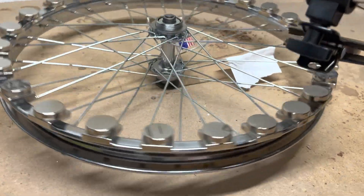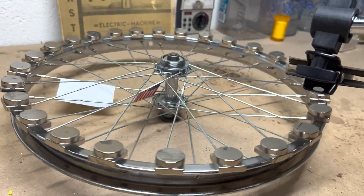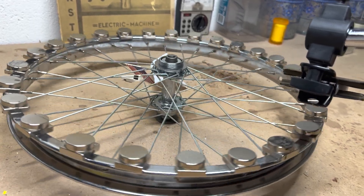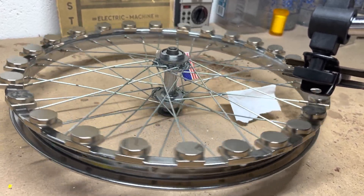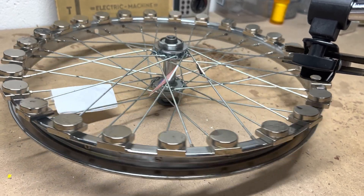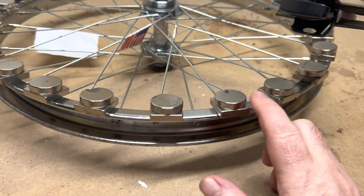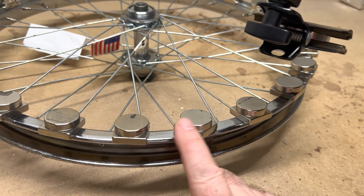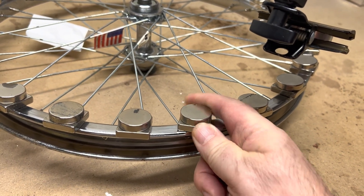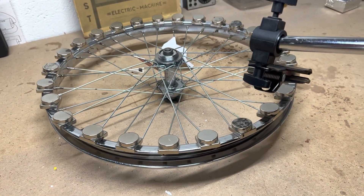Watch what happens here. I have to hold this armature because it shakes. See, it wants to run — that's not a question anymore. It's just that when it gets to that spot — right there — there's that spot again. This is where I moved the magnet. Let me put one of the magnets there that has a hole in it and see what happens.